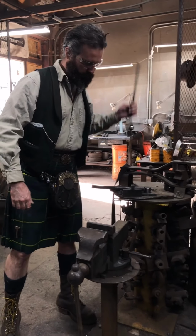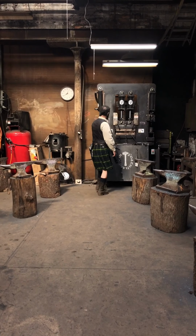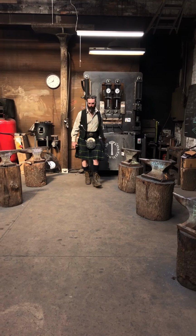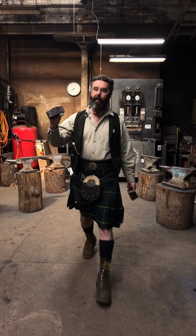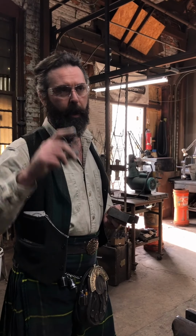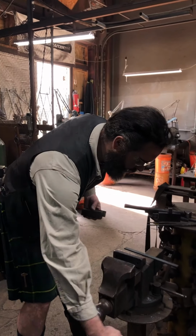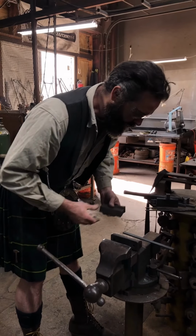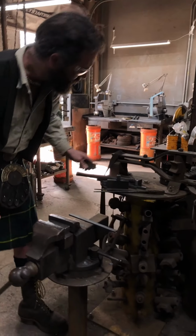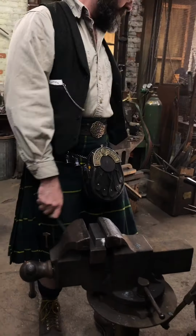So I've got a 1/4 inch as my width spacer. I want a little bit of upward space as well. I'm just grabbing a whole pile of gubbins from over here. It's good to have little blocks of steel kicking around in different thicknesses. So over on the press, we use these as depth gauges for when we're using top tools and that kind of thing. But they get really, really handy on this kind of stuff because I can do a real fast shimming setup. There we go.